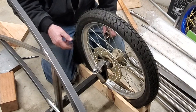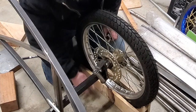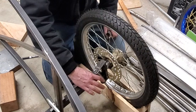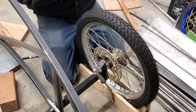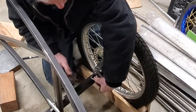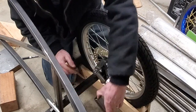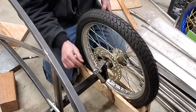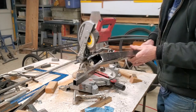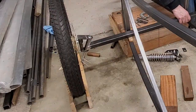I've clamped it all down, eyeballed it, and measured it. This is at the right inclination. I'm taking my axle beam, laid it flush to this tube, and with a straight edge and white chalk I'm marking the angle I'll need to drill the one-inch hole. I didn't catch the drilling on film, but here I'm cutting down the center of the hole so it makes a nice little saddle to attach to the kingpin housing.